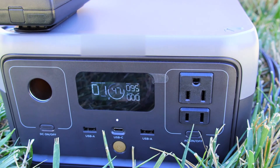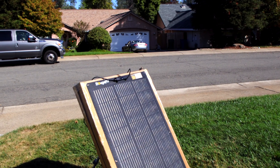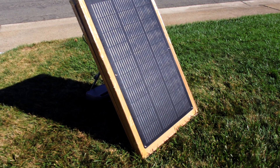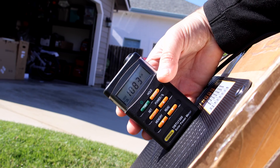I will normally see about 94 to 98 watts out of this rigid panel, which does pretty well for the most part. I let each solar panel sit out in the sun for about 10 minutes so they could heat soak, because a cold panel will put out more power than a warm panel. Checking with the light meter, still getting about 1,080 watts per square meter, so we'll see what our numbers are.